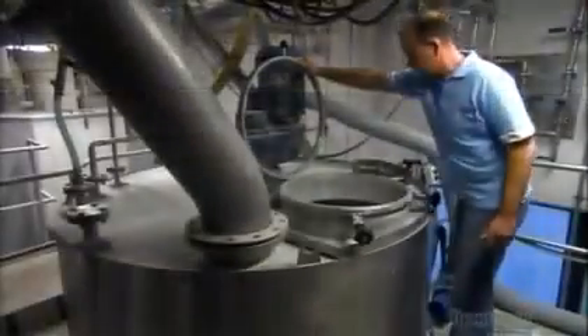To make spark plugs, they blend alumina ceramic powder and other ingredients with water. After a thorough mixing, the milky-looking brew drains into a big dryer, which converts it back to powder. The powder funnels into a mold. It closes to press the powder into the shape of spark plug insulators, and a binding ingredient in the mix helps them keep their shape.